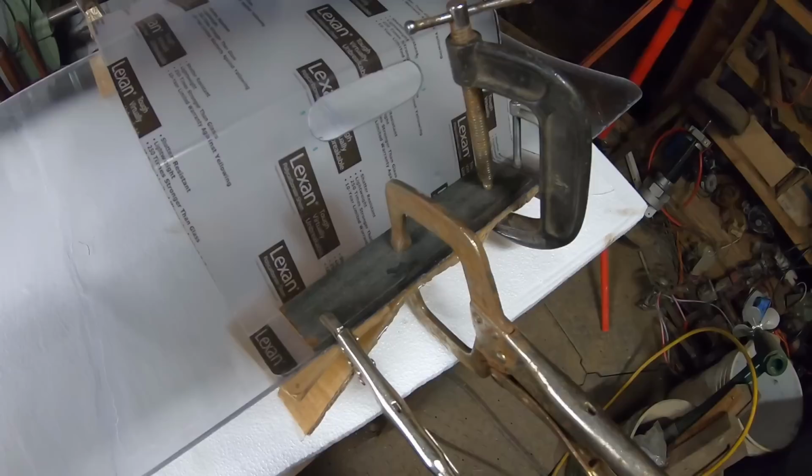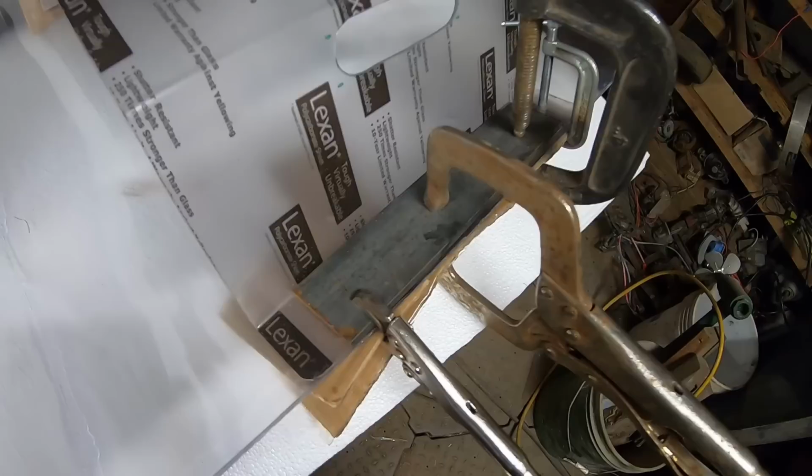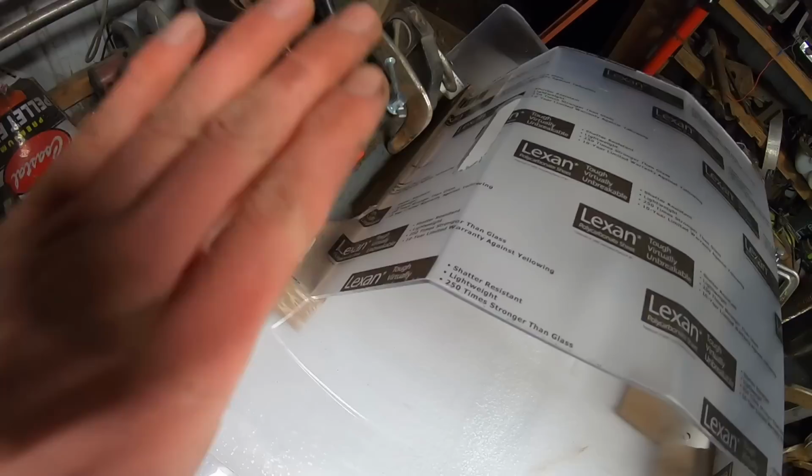All right, so I've got every working clamp I have on this thing right now in order to try to give it a nice, even, smooth, glued surface. Something that looks something like this, where there's no air bubbles or no air pockets, so it really doesn't stand out at all. Another thing I've done is to even out the pressure. I put some steel plates on either side just to give the clamp some more surface area to push against,